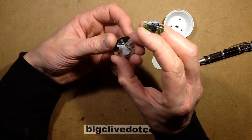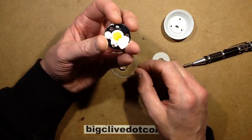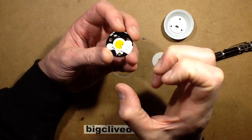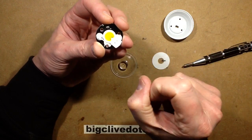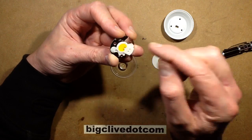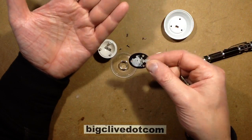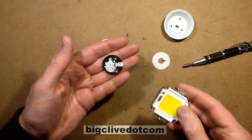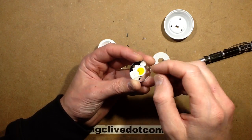I put the power supply across these two pins and gently cranked the voltage up, and the fault appears to be the classic one we see all the time — the bonds on the LEDs have failed. Above a certain voltage, the LEDs started flickering, and as you turn the current up a little bit and they heated up as a result, they just flickered less often and then just stayed open circuit. So it's a thermal issue with the breaking of the bond. The little power supply is probably fine — it's the LED itself that has failed.